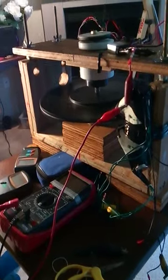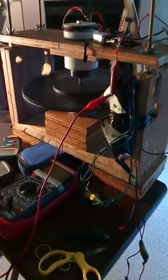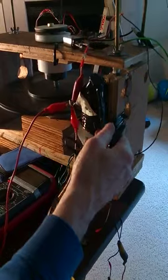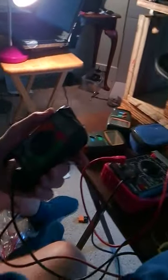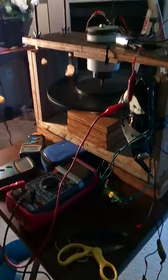Okay, it's going 250 RPM. Let's see what the voltage input is — 7.7 volts, 7.7 volts, 7.7 volts, 50 milliamps. That's all it's running on.